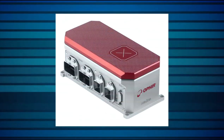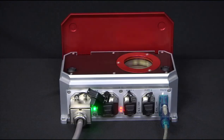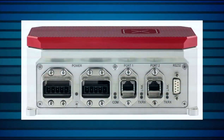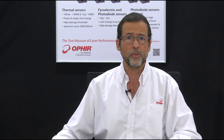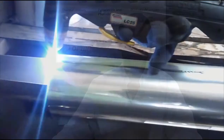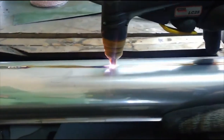The Helios is tailor-made for the production environment, with a robust body, motorized protective cover, and industrial interfaces — PROFINET and RS-232. It measures industrial laser powers up to 12 kilowatts. All it needs is a short pulse exposure, from as short as 300 milliseconds depending on the power. There's no need for water cooling, so the footprint is small and the process can be kept running with minimal interruption. A typical application of the Helios is to check the power of a laser welder in between welds.